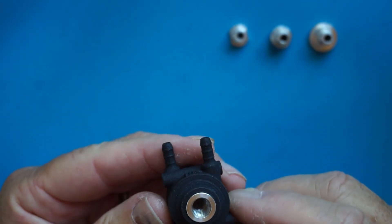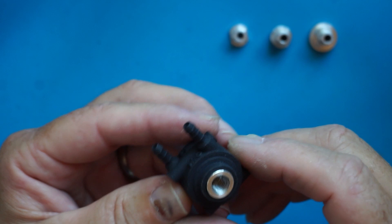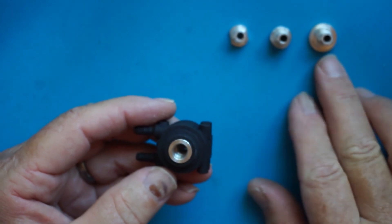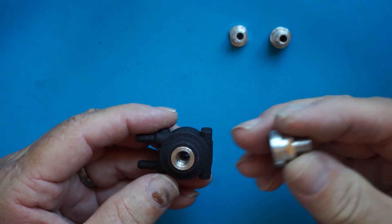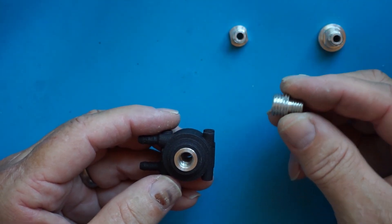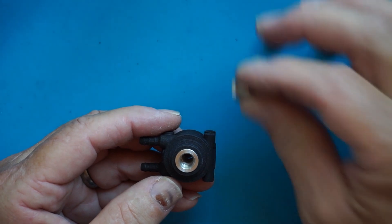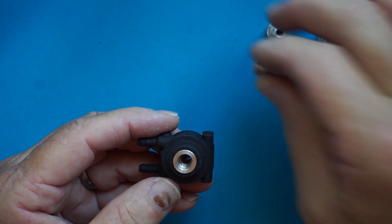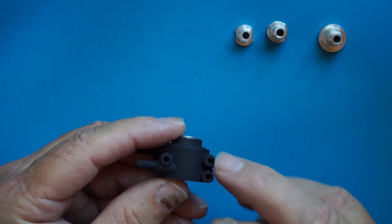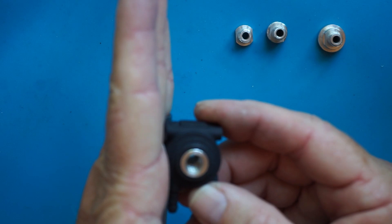Talking about installation, we've made installing this a lot more flexible, because as you know Zesty is all about flexibility in 3D printing. It comes standard with three inserts: the standard groove mount insert, an M12 fine insert that can be used for instance with that fantastic smart effector that David designed, or just the stub insert used to hold the PTFE tube in place. And that's when you use these side holes on the unit to mount it, for instance if you mount it like this onto your printhead.